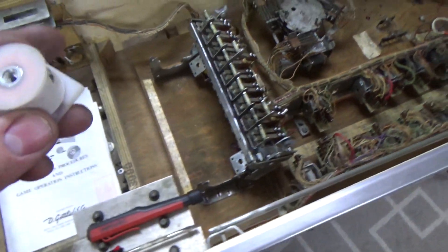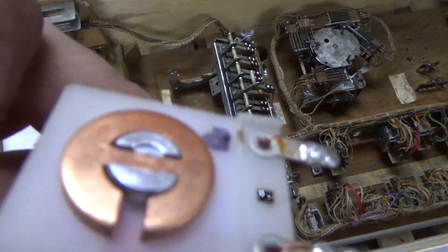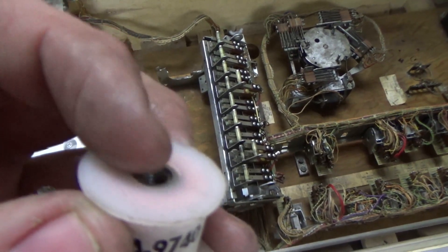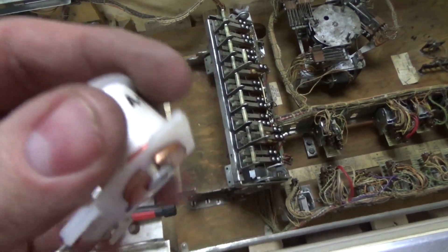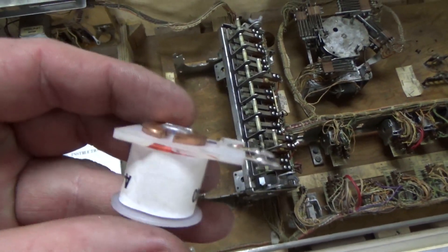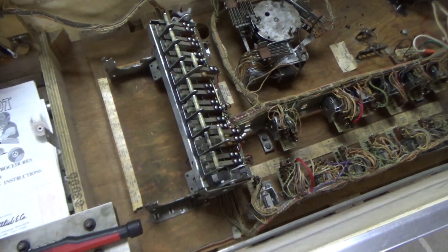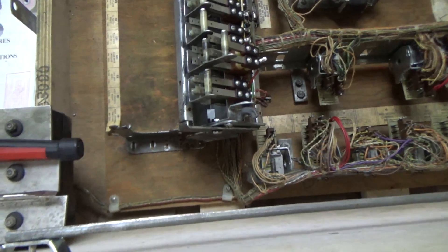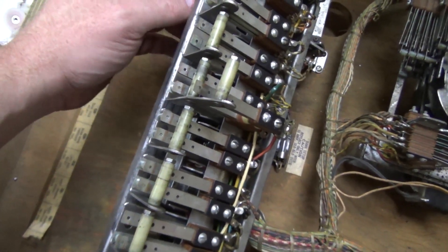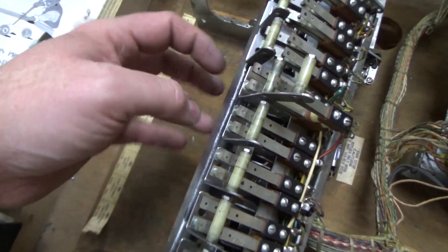I worked through the rest of them and didn't see anything super significant — I just cleaned all of the contacts. None of the other coils had been replaced so they didn't have that same problem, although it was a problem on both the tilt hold relay and the hold relay. Now here in the bottom is another new coil, but it's made different — it's lower than those other ones. And on this side it's completely flat, so if you put that little washer in there it would make it stick out slightly. It seems like this is the correct bobbin for the coil that should be in there — those are just made a little bit differently.